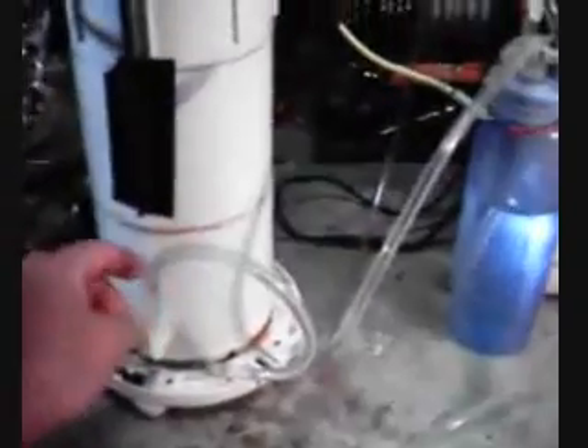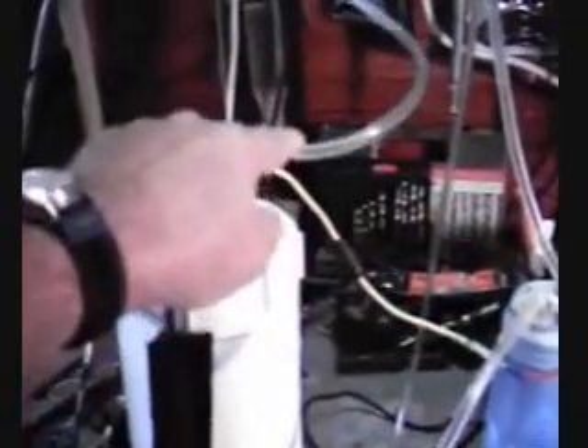The air bubbles are carrying fluid with them up to the tank. I have a spigot nipple on the other side about halfway up on the tank. Water that's withdrawn comes back down here and connects by way of this fitting, and goes inside the unit, so it's getting cooler water. The hotter water is coming out at the top and going up through this hose. I've coiled the hose so you can see the bubble activity — the bubbles are carrying water — so it has its own built-in pumping action.